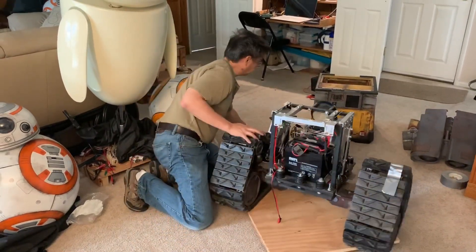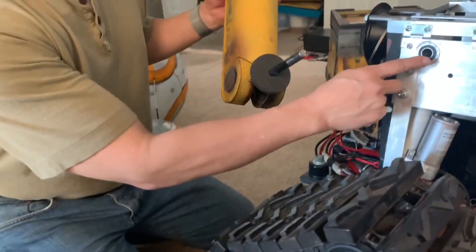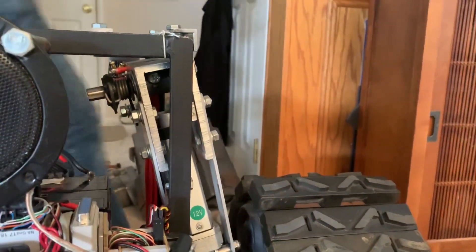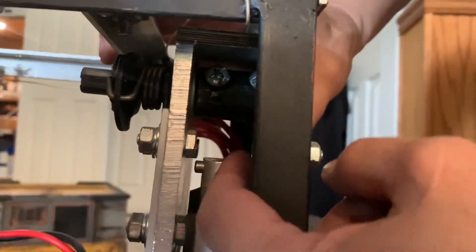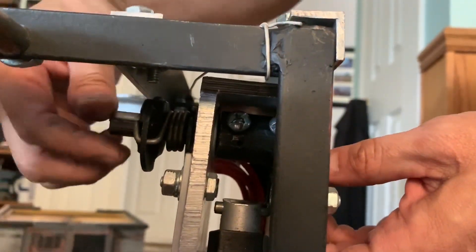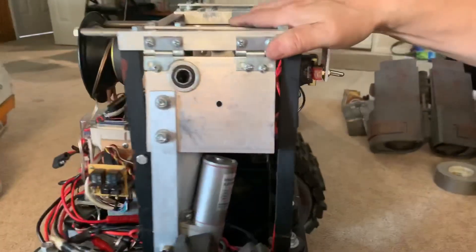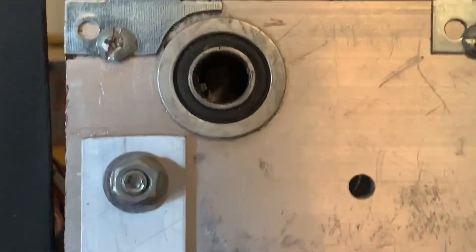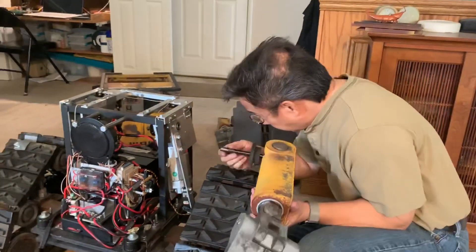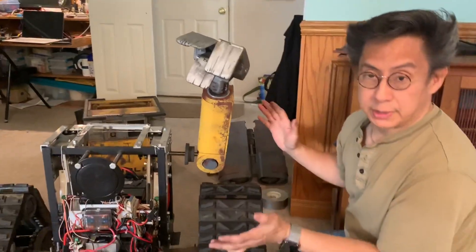I'm going to put this arm in. The way I connect my arm is there's a half-inch shaft here with a keyway cut into it. I have a bearing on this side and on the other side of the mechanism, and what we see inside is a connector. This shaft connector is holding the shaft in — it goes about halfway through that connector — and the purpose of this shaft is just to hold that connector in place. Inside the connector I also put a piece of key stock that matches up with the arm keyway. There's nothing else that holds this arm in, just merely forcing the arm into the shaft.